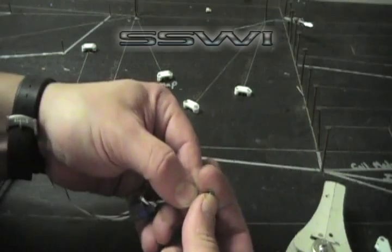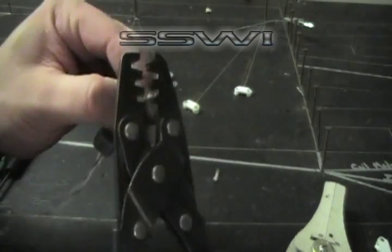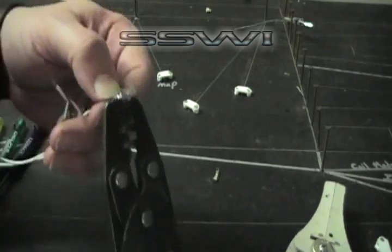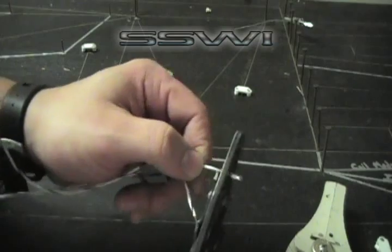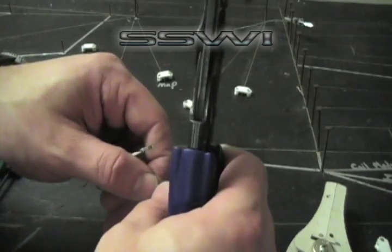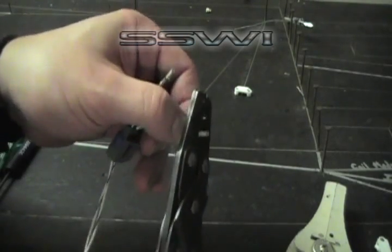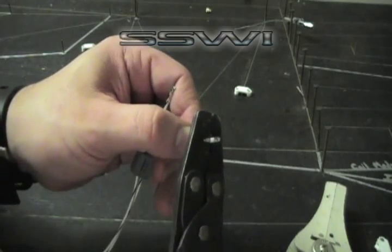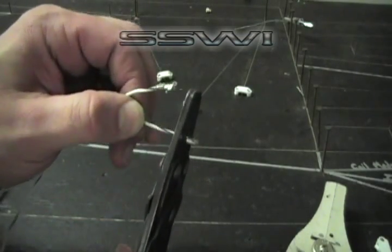Place your terminals straight on to your wire. Start in D, then E. Back side: start in D and then E as well. Crimp down. Five pound pull test. Secondary insulation lock — crimp that down with D and a little tug with E, then finish up with a five pound pull test on E.